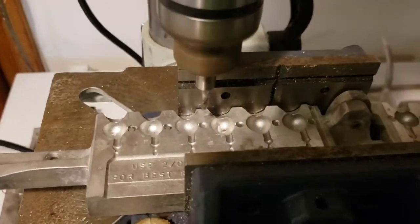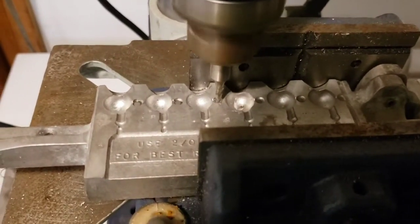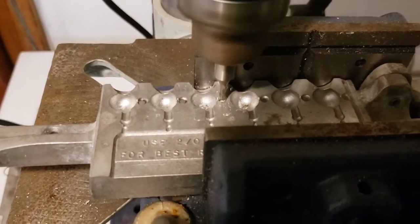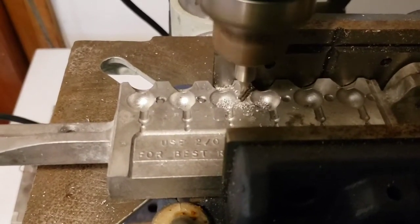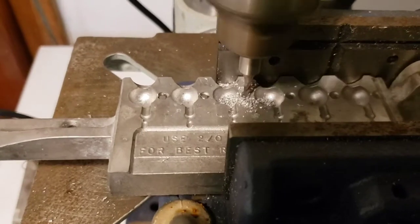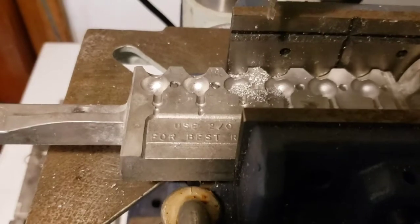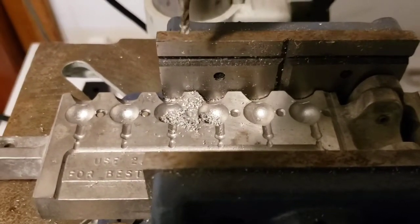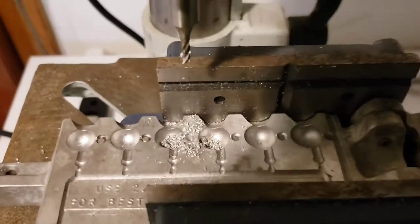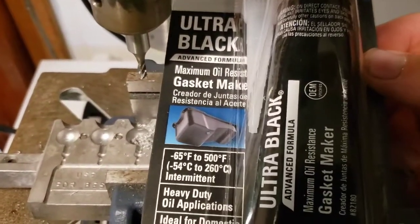It's aluminum. Drill's pretty nice, pretty easy. Take it slow. You can drill it a little deeper than it needs to be — it's fine. It can be filled in, and then when I go to drop the magnet in, clean the hole out.